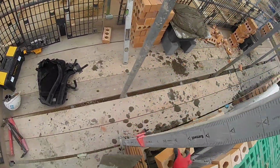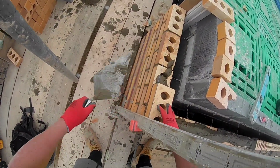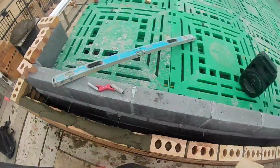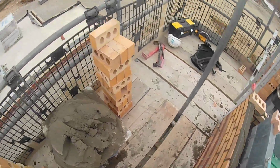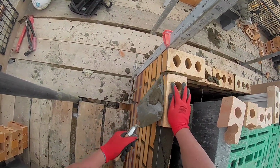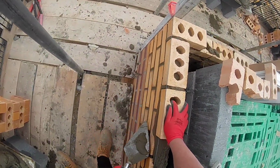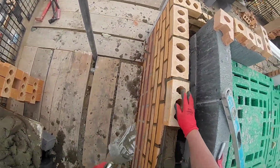And that's where the half was found. So obviously, if this plot had been bonded out right, there wouldn't be any three quarters in it, everything would have worked brick easily. There's three quarters in the front anyway, even before me finding the half, so it is what it is. It just makes the build a bit more awkward, using more gobbo as well, it slows everything down a little bit, so you've got to be prepared to come against stuff like this.